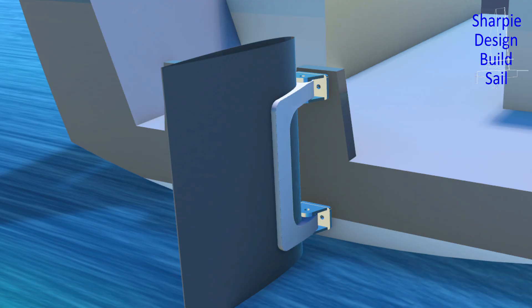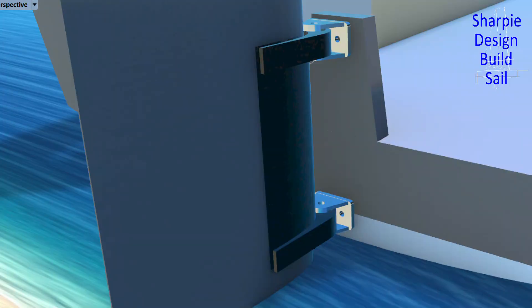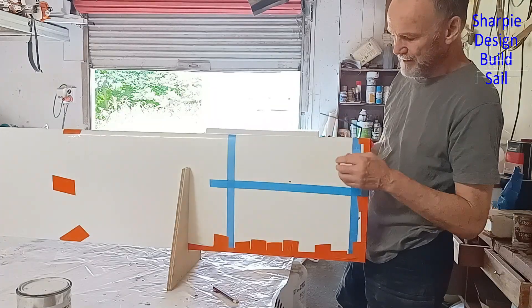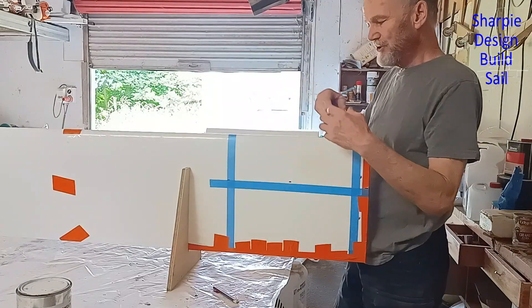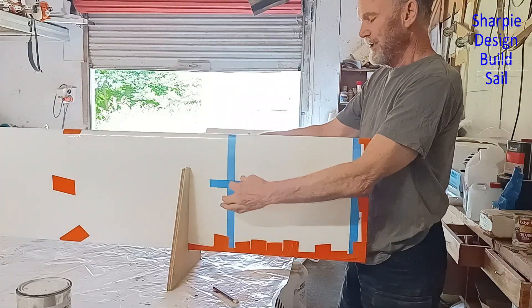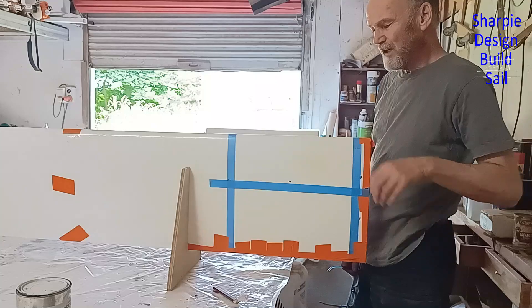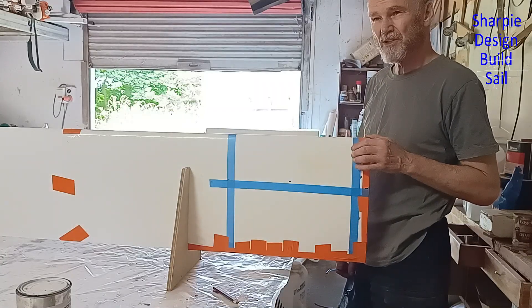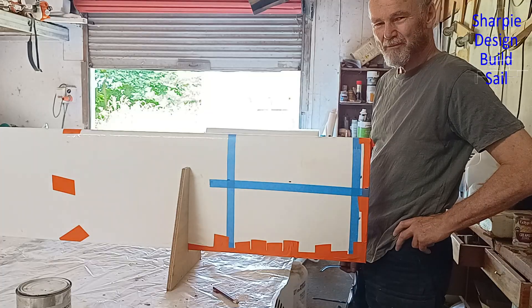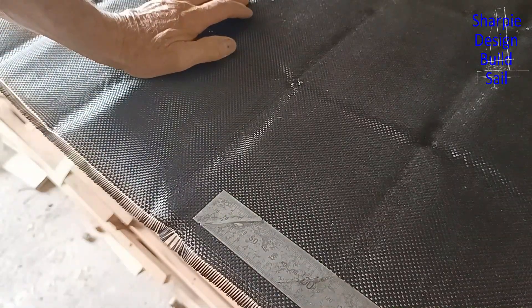At one point I was pretty determined and did some drawings for an aluminium casting, but it turns out I've got just enough carbon fibre to build this all out of carbon. It'll be pretty similar to a rudder box I had on my Elliot 7.8. The first part will be putting on layers of carbon around here, up to eight millimetres thick, and then there'll be two bands of solid carbon uni — a mixture of uni and cloth — that go around here and along here for the hinges and pintles.